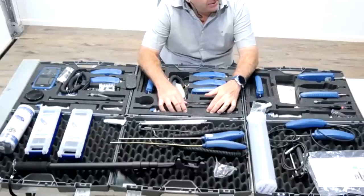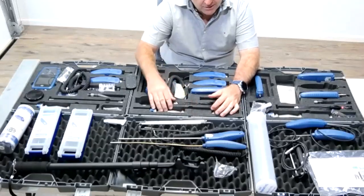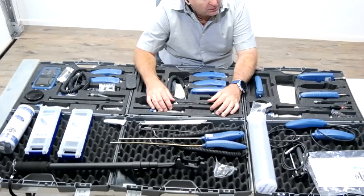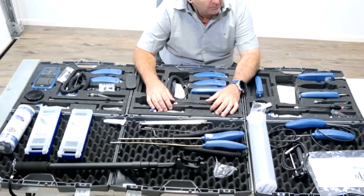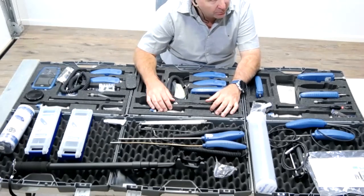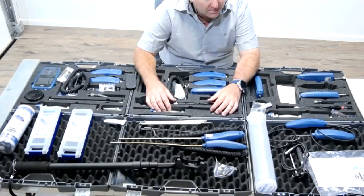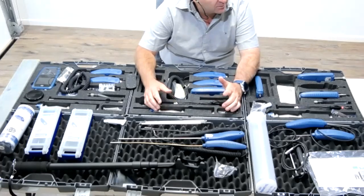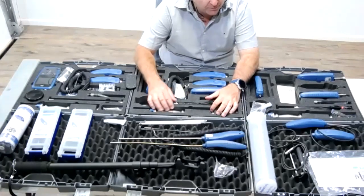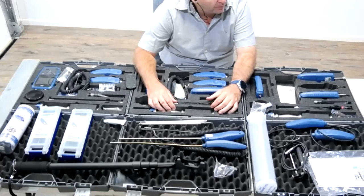Now, there are a lot of meters out there that are sold without this. A lot of people who go into heat drying timber floors don't understand, when they go in to check the timber floor, that most meters without this setting are set at about 20 degrees. Say on day 1 the timber's reading 15%, and the timber floor expert says it needs to read 12 in this area because it's cupping, so we need to pull 3% of moisture content out of the hardwood timber floor. We put a heat dryer in there and heat the floor up to 40 degrees.